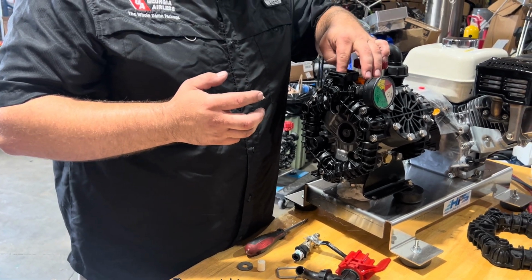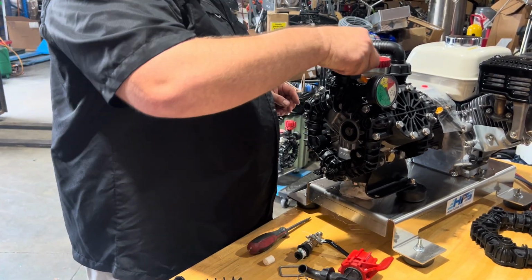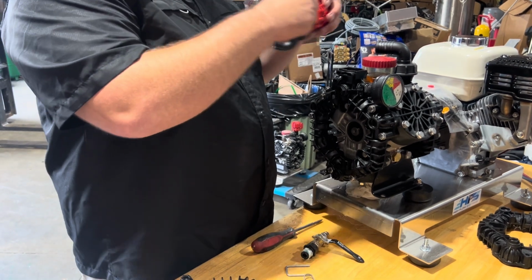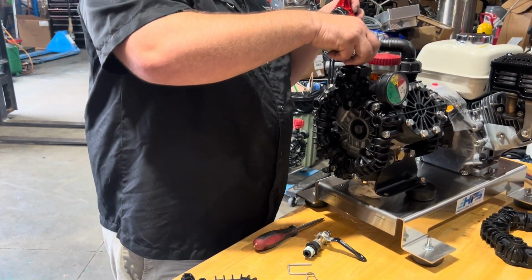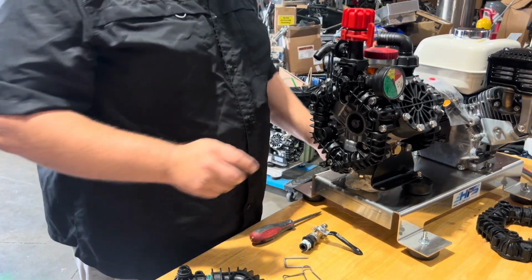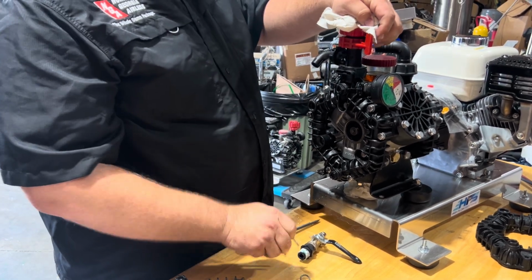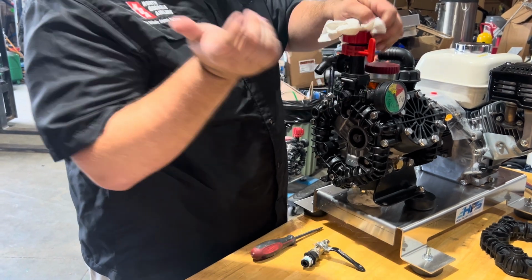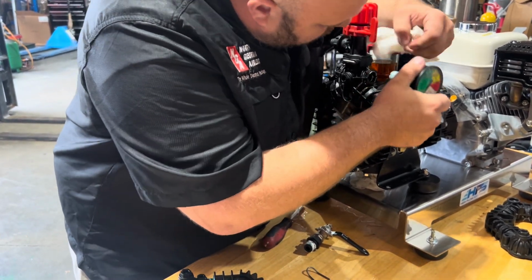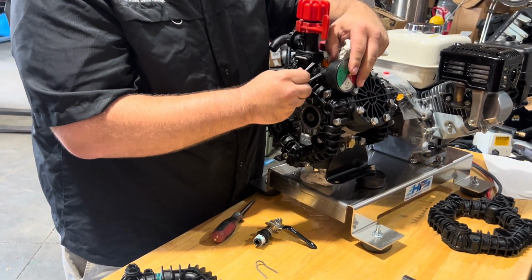Drop this O-ring in the top, little groove it sits down in. It'll be very obvious where it sits. The washer that I said not to forget, it will not work without that. The ceramic piston, which you can actually sit down on top of the washer. It'll kind of lock in there, make installing it a little easier. Pop that together. All these things, you'll kind of feel them pop in. It is much easier to get these things to pop together when you have grease involved. No grease, this will not be nearly as easy. These side fittings, there are little alignment tabs that you do have to have lined up to get everything to sit back in there properly.